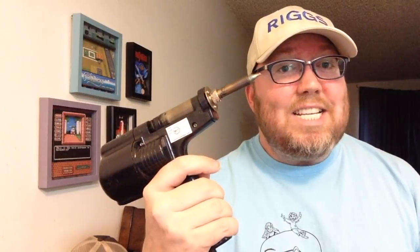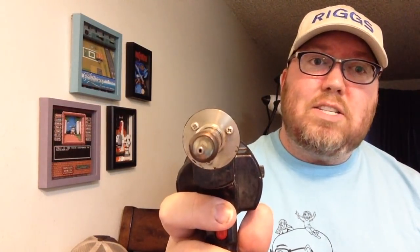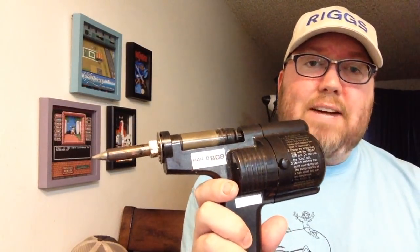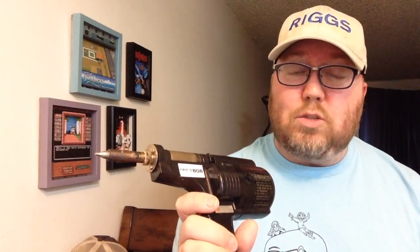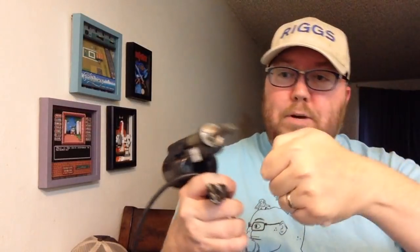And to go with that soldering iron, you need a de-soldering iron — this actually sucks up the solder. If you're going to remove the pins from an old board, don't destroy any games you don't have to, but you are able to do that. This here is a de-soldering gun; you put the pin on there, pull the trigger, and the solder gets sucked up into this chamber. They don't make this anymore — this is the Hakko 808 — but there are similar ones on the market, link in the description below. They do have a de-soldering bulb sucker as well — that's the cheap way to do it. If you're just getting into repros and don't know if you'll do it long-term, that little bulb thing might just be perfect for you.